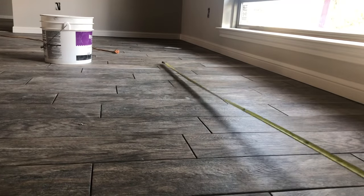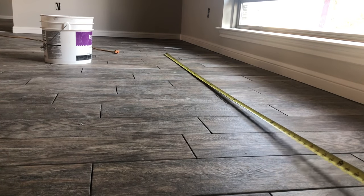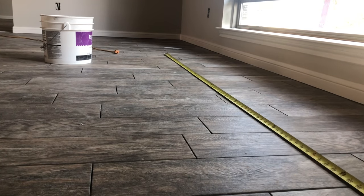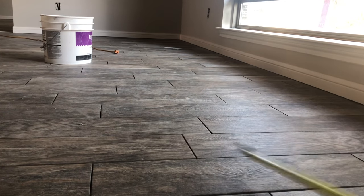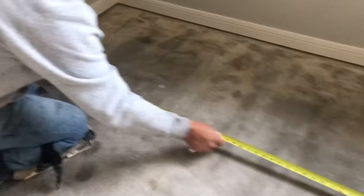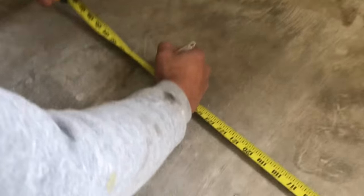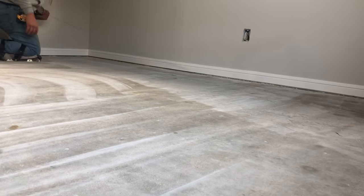In order to tile this room we actually need to start backwards — start from the farthest wall and finish by the door so we can get out. In our case we have a bunch of floor already laid, so we're going to take a measurement from the door down to the wall. I'm going to leave about two feet of space to tile.